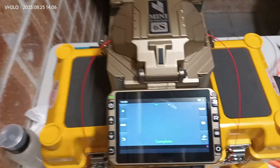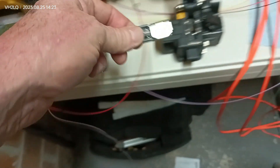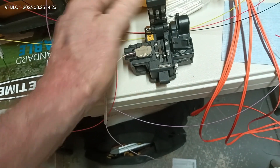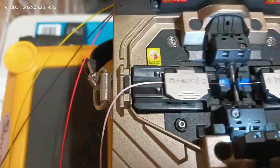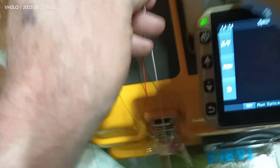The arc test is completed and ready to go. We use a FiberFox Mini 6S — it's a high-end fibre splicer. It does pull tests on each splice, and we can remove the fibre holders. We strip and clean the fibre, sit it into the fibre holders, drop it into the cleaver, cleave it, then move it all up into the fibre fusion splicer of the Mini 6S. It's exactly where it needs to be — perfect every time — the right cleave angle, the right distance in the machine to the fusion splice.